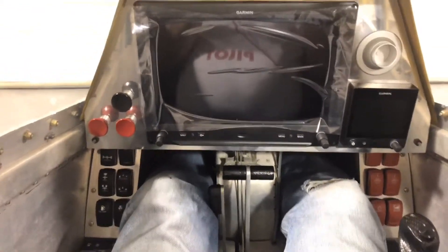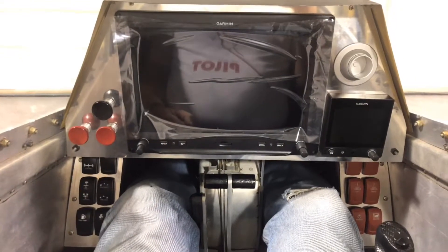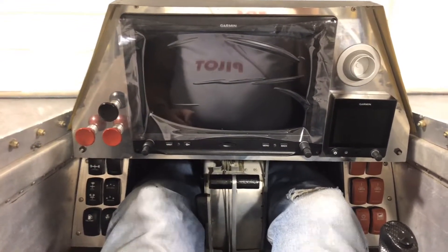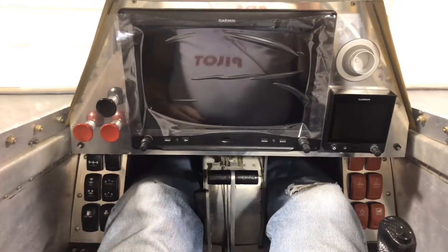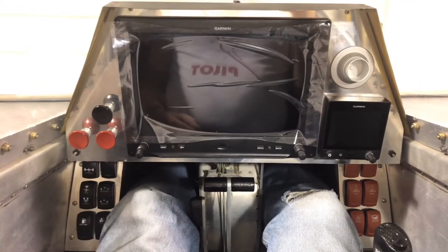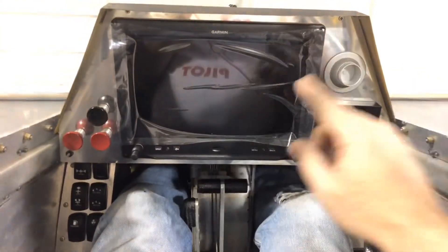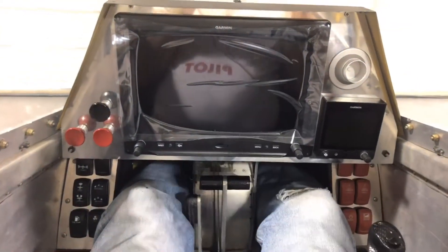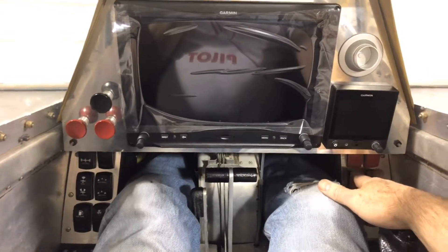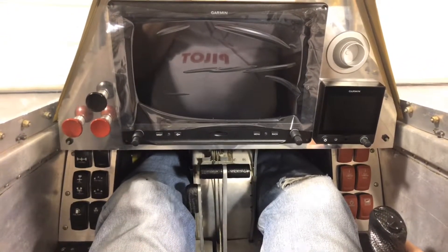One of the things I've actually changed in ideas: I've had so much trouble getting a 12-volt alternator system designed for that engine. There's an existing 28-volt alternator that feeds a 24-volt system. So I got to thinking, let's add up what I've got in the aircraft that had originally been designed for 12-volt and figure out what I'd need to change to convert it over to 24-volt. It turns out all of these Garmin avionics are designed to be 12 or 24-volt, so the remote stuff in the back works too. The LEDs that illuminate the switches do need a 12-volt power supply, but that's a pretty easy conversion to do.